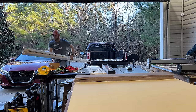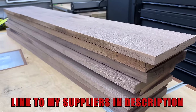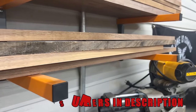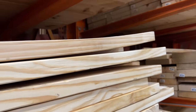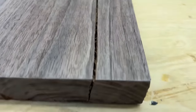For instance, if I go to my local store, pick out some lumber and bring it home and use it right away, theoretically it's going to be okay because I'm only a few miles away — same temperature, same humidity. But I do get hardwood shipped in because we can't buy them locally, and those I let sit for a week, two, sometimes months before using them. 48 hours is a good minimum rule of thumb. If you use it right away, there's a chance the wood is going to bow, bend, and split — that's what you're trying to avoid.